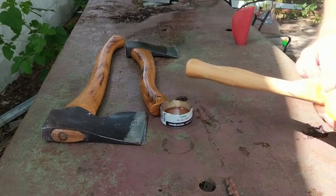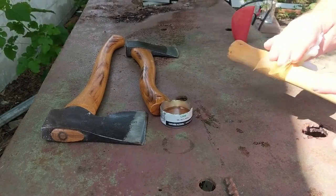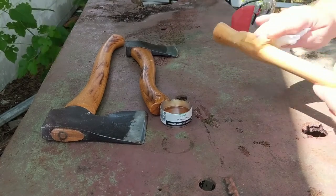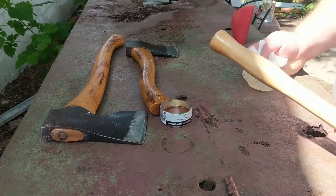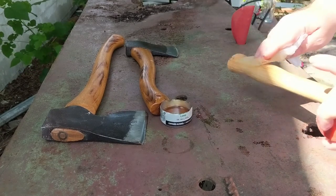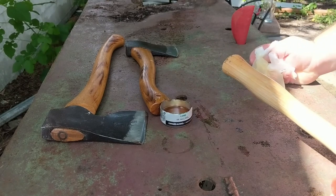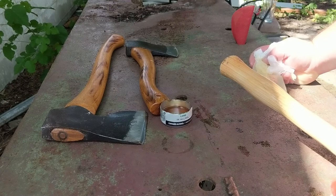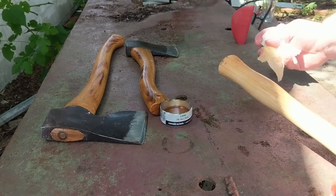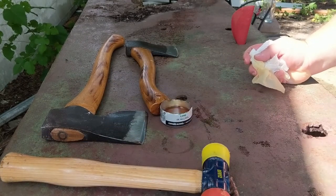Just a little coat — I'm testing to see how it soaks in on this raw wood, and on such a nice warm day it should go in pretty easy. That's the biggest challenge when you start adding pine tar and beeswax to these coatings: getting it into the wood and not just sitting on top. A lot of people will just wax wood and constantly keep doing that with good results, but I don't always have time. I like something pretty robust — these treatments are pretty much a once-a-year thing.